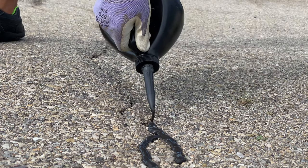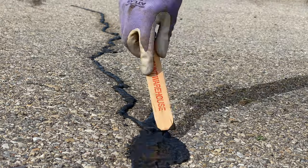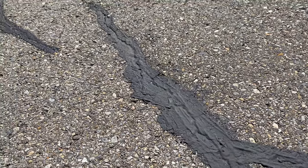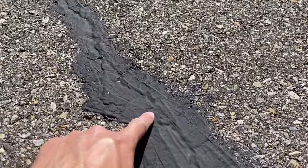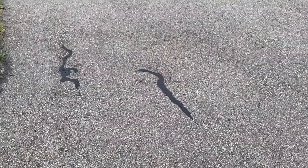On this smaller crack it's quite simple. After clearing it out, the filler material is applied and then spread out for additional surface coverage. Once dried the filler is nice and durable — even on a hot day, a day later it's totally dried and hard to the touch. All the repair work has been done and the driveway is now ready to be professionally sealed, and the best part is I saved myself a handful of cash.